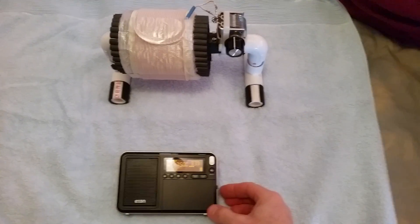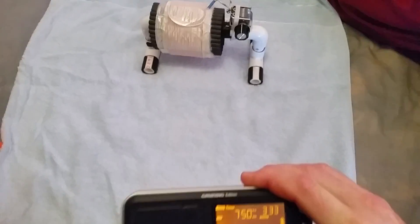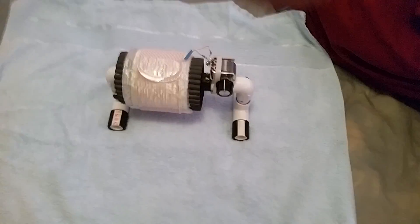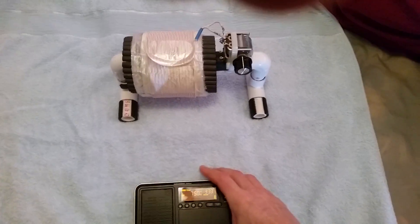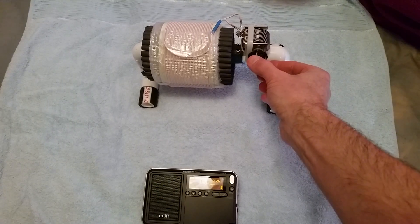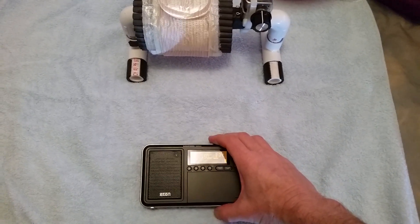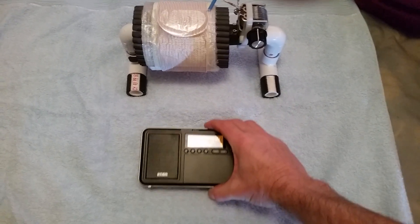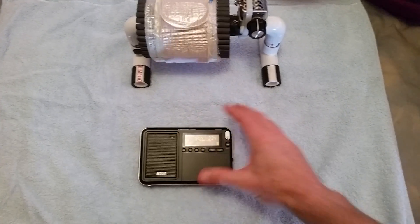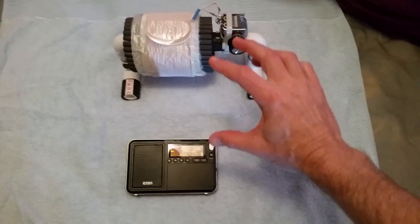Be advised that with any FSL antenna — before I explain this, let me pull it away once more. You can see we're back down to nothing. In the FSL antenna, be advised that because of the high-Q tank circuit, the inductive coupling tuning is razor sharp. And not only is the inductive coupling tuning razor sharp, the distance to the FSL is also sharp — if I'm off as little as two inches in distance from the FSL, the signal drops.